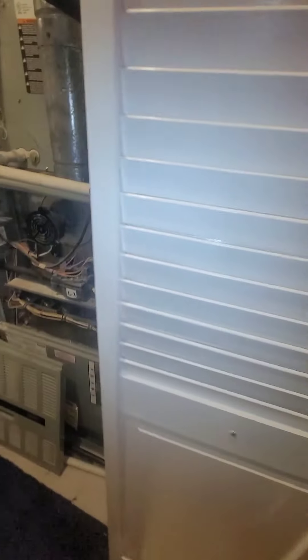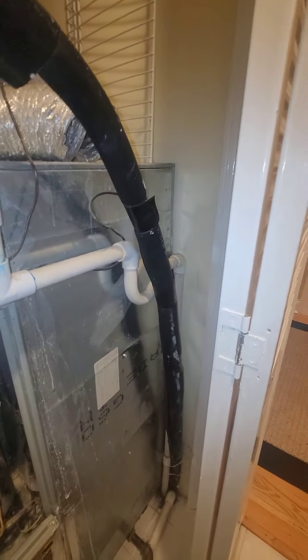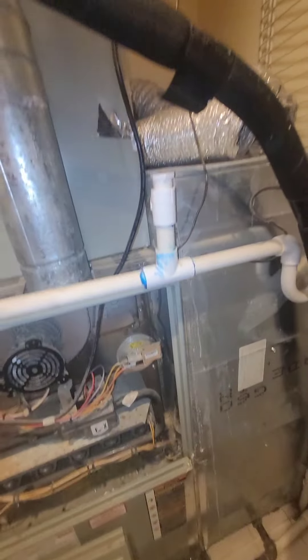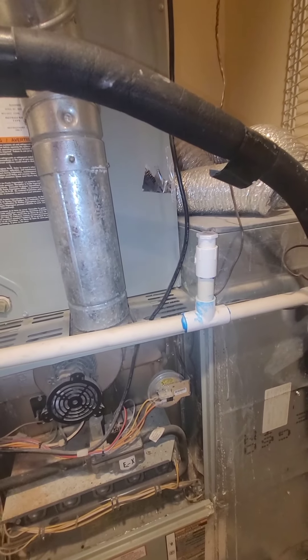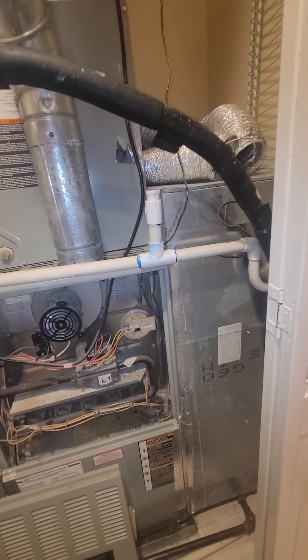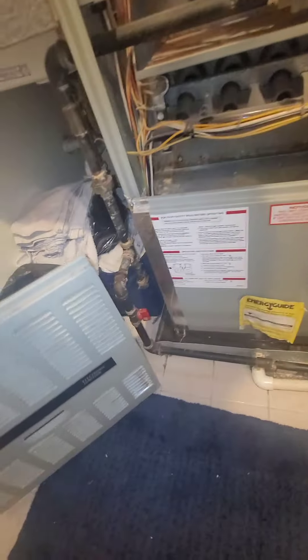Gentlemen, this is your return box. I don't know why they did it like that. They, in essence, doubled the box. I don't see a reason to have it like that. We can most definitely pick up some space here by possibly shrinking this box down, copping it off a little bit shorter, and just putting a 16-inch piece of round pipe coming into the side of the furnace. There's no reason for this double-hung situation they've got going on here.